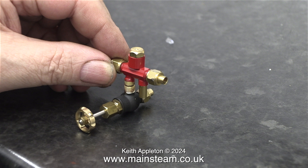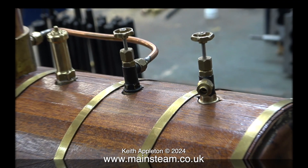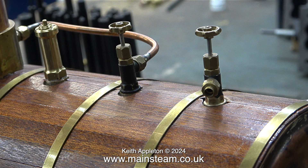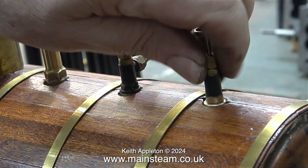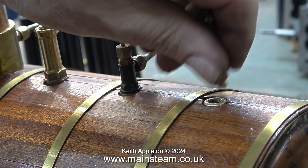Once again, I would like to talk about scale. In my opinion, this tap is miles too big for the injector. This smaller tap, which is almost identical to the ones fitted to the boiler as steam outlet taps, looks far better with this small injector. In my opinion, these steam valves on the boiler — the original ones — really do look incredibly wrong. These valves are threaded quarter by forty to accommodate five thirty-seconds of an inch diameter pipe.